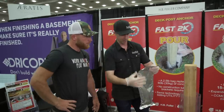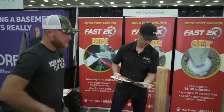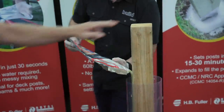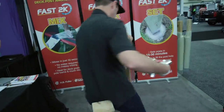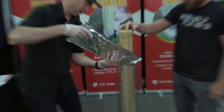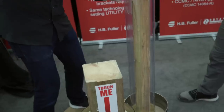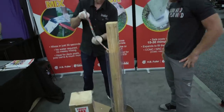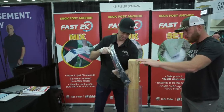There's a rip-off tab. I put some gloves on because you don't want to get this on you — I've ruined many clothing before with polyurethane foam. Then all we're going to do is pour it in here. We're going to coat the outside of the post as it's above grade too, because that polyurethane is waterproof. Check that out — it kind of gathers at the bottom. This is some kind of slow rise foam, probably. It's just sitting there at the bottom and it's slowly coming up. They say that this two-and-a-half pound bag of foam is going to replace 60 pounds of concrete.